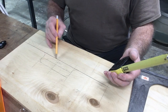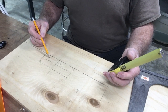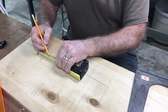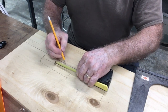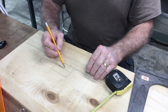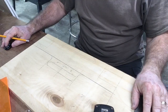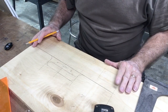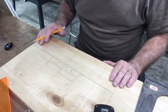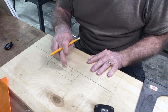To create this opening, the slot is one inch, so I'm going to come over an inch and a half and mark that on each side. Then I'm going to make it so my Forstner bit can drill a hole here and here. This portion is exactly the way my old ones were, because it works so well. The only new part so far is the handle.